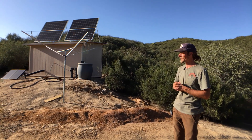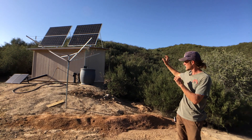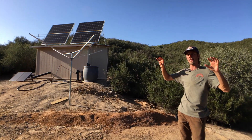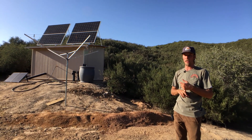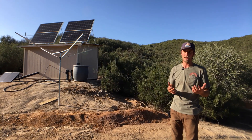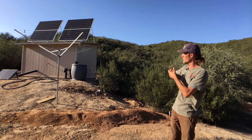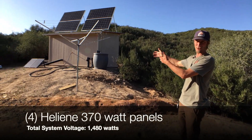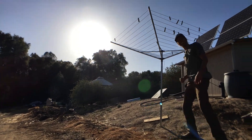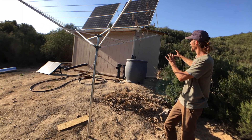For this system, we cut out the two middlemen and went straight DC to a DC battery bank. Everywhere we could — in the laundry shed and in the yurts — we selected DC appliances, which can be found most readily in the van life and RV world, since they can't afford to carry around extra batteries and panels. These are each 370-watt panels, around 1,400 watts total, and they're also using great tools like this amazing sun-catcher clothes dryer to minimize their electrical energy footprint. Let's head into the power center shed and check out what's actually happening inside.